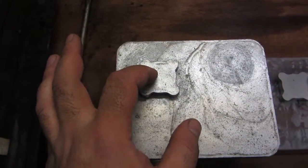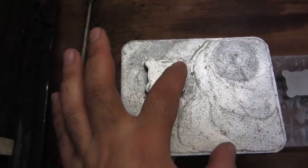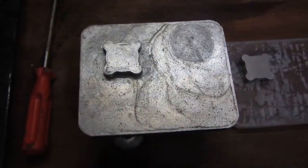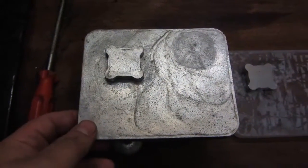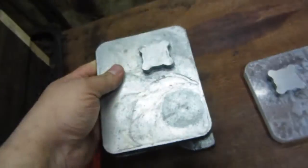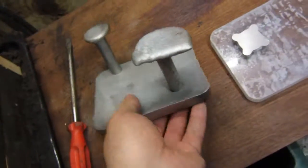Once it's located in place, 4 screws come through these holes which will be drilled in the 4 corners, and the motor will be screwed onto this plate, and from the other side it will drive a belt drive similar to the Unimat SL lathe, and this will drive the milling machine at various speeds. And this is an excellent casting for what I've done. Just needs neatening up on the belt linisher. It'll be fine, and once it's painted it'll be amazing.